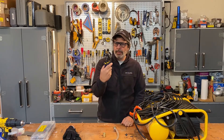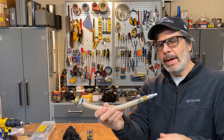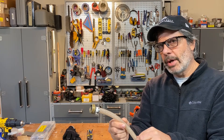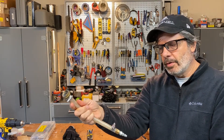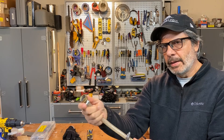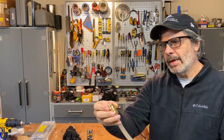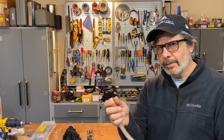I'm using a couple pairs of channel locks. The key to the operation is this adapter I made. It goes from my high-pressure hose fitting on one end through high-pressure hosing — you don't want to use garden-variety hosing here, make sure it can handle the pressure of your air compressor — and on the other end I have a female hose fitting. This lets me plug into my compressor air hose, screw onto a garden hose or silcock, and blow out my lines. I also have a male-to-male adapter so I can handle all known hose genders. I made this myself.